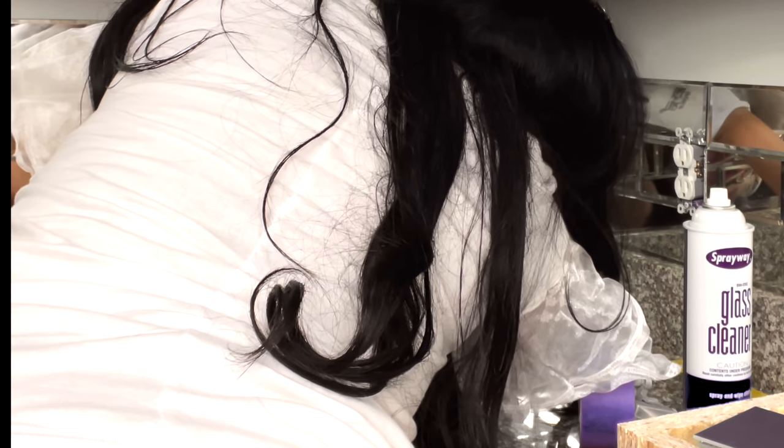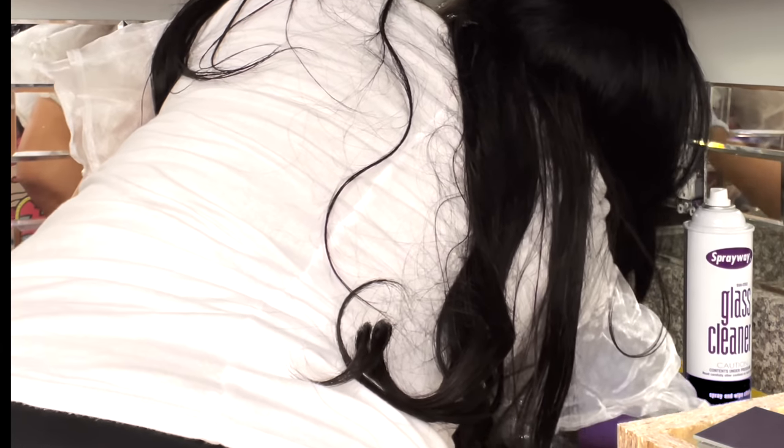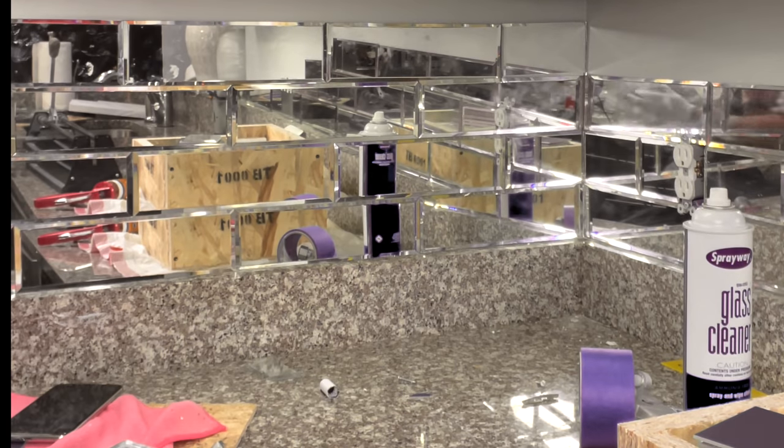So now I'm going to place my newly cut 5-inch tile right here in the corner, and this is how I get that subway pattern, by alternating a 5-inch and a 10-inch. The 5 inches, I always like to start on the ends or in the corners.